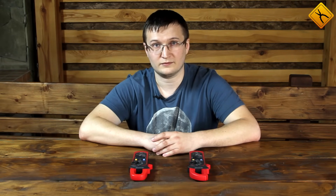The main element of a clamp meter is the current sensor. There are two types of sensors used: one type is a current transformer and the other is a Hall sensor. Depending on the sensor used, the meter may measure either alternating current or both direct and alternating current.